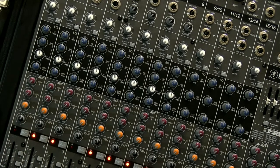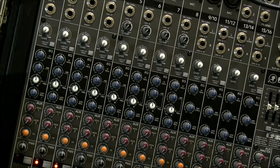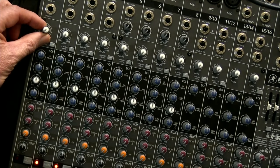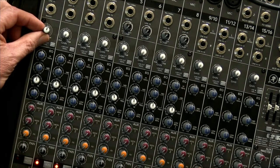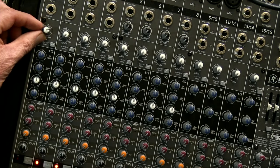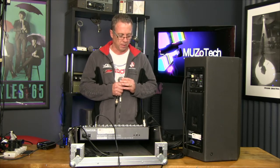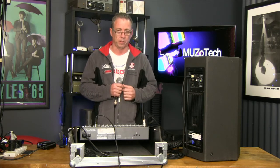Now, if you look up the top, just below where the XLR input cable goes in, the first knob is always — or almost always — an input gain. That sets the volume to match the signal from your microphone. On this desk, you can usually start around two o'clock. That just sets the level into the channel to match the source — in this case, a microphone. We can adjust that later, and we'll also talk about gain setup in following episodes.